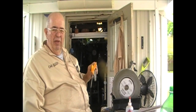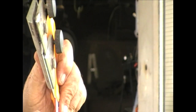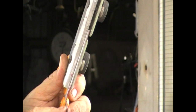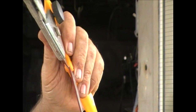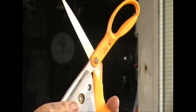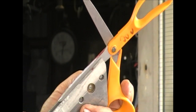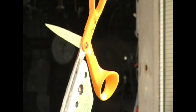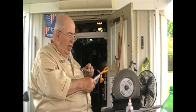Not about to say you can't live without it, because it's a nice feature. I said I put the red marks on them. You see the red line? That's the cutting surface. This is not the cutting surface, this part. This is this top. Now, when I ran it through the machine just now, I had that red line on top of this, and if you can see it in the light, 90% of it's gone, which means I'm at the right angle. I'm going to go back and grind a little bit more, but that red mark allowed me to know if I was getting close.